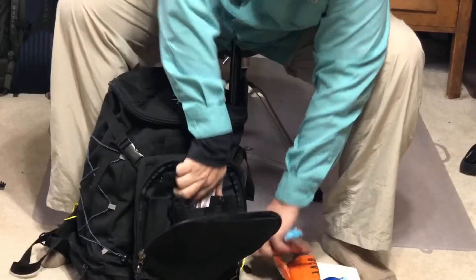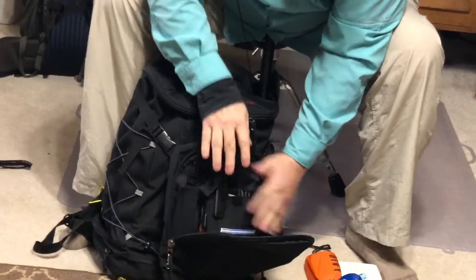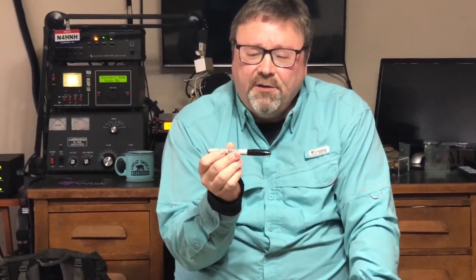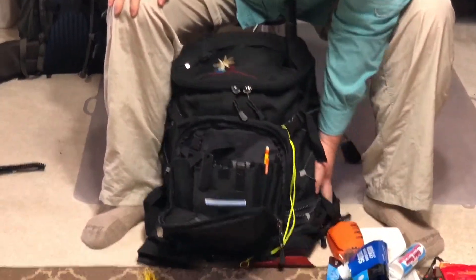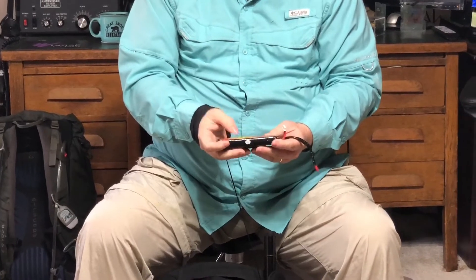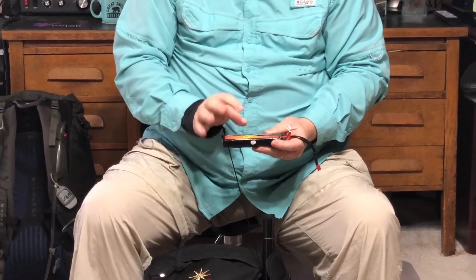The inner pouch also holds protein snacks — I carry some in my pocket too. There are two pen slots: one for a pencil and one for a Sharpie. The Sharpie is useful on the Appalachian Trail where you can sign your name on a pad at cutouts in rocks. This is the power source for the QRP radio: an 11.1-volt LiPo, Red Tiger brand, 25C, 3000 mAh — more than enough power for the QRP radio for probably an entire weekend of SOTA activations.